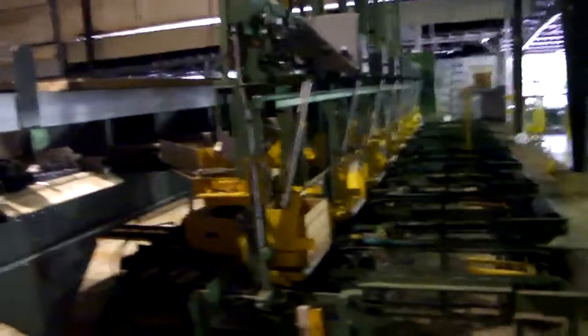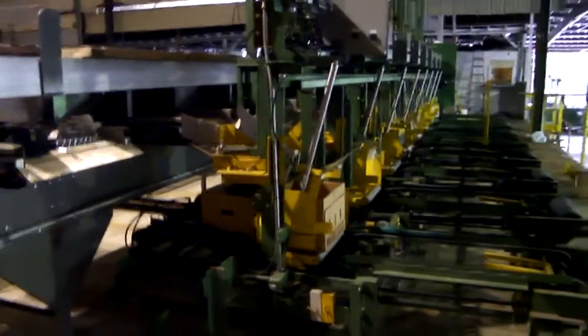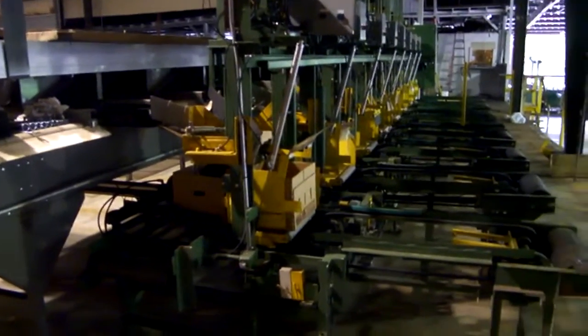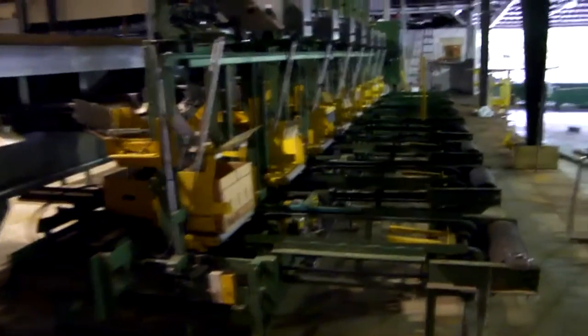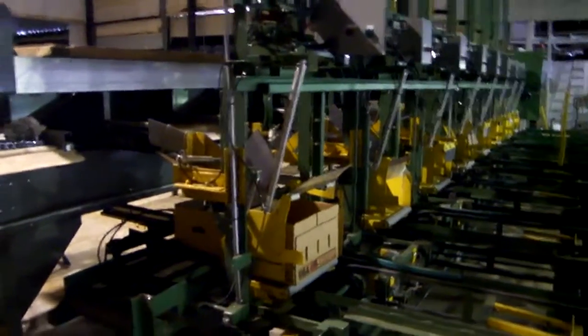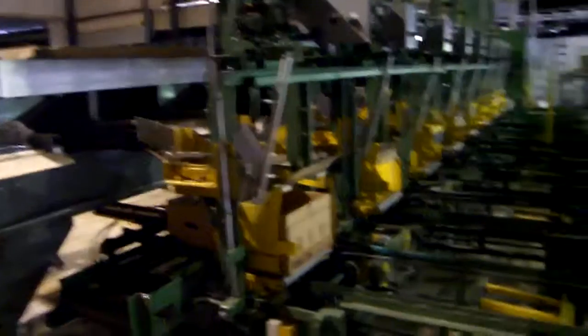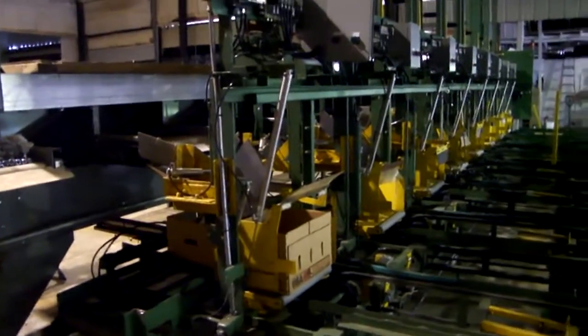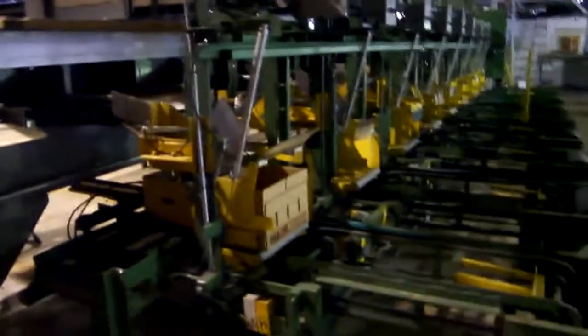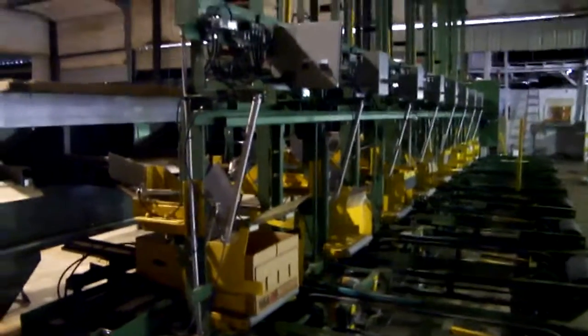This particular filler is all pneumatic. It has a real quick cycle time because the empty box pushes the full box off the scale, so the cycle time is real quick, so you end up having a faster filler. It'll do about 6 boxes a minute. The non-tilt varieties I've built will do over 10.